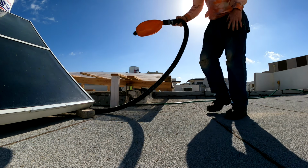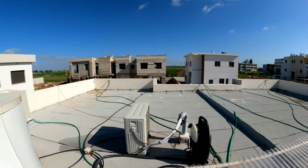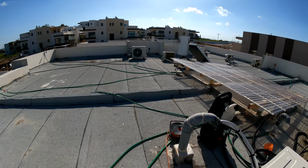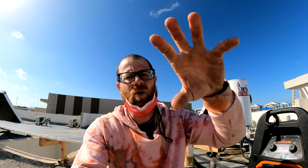Okay. Nice. We're good. So, I'm going to unplug it, move it down. I mean, I'm using a lot of smoke here. Whew. They have methods where you just put smoke bombs in there, it lasts about a minute, but then works for certain cases. But when I do these long diagnostics, it's good to have a continual supply of smoke. It actually doesn't throw the smoke out the whole time. What it does is that the fan stays on, but the smoke comes out and bursts. That's how it works. All right, let's get going.